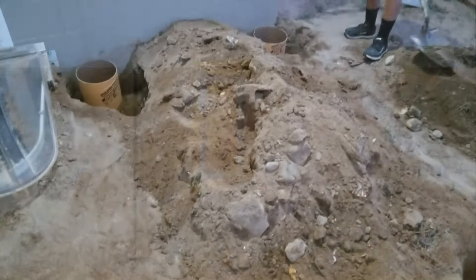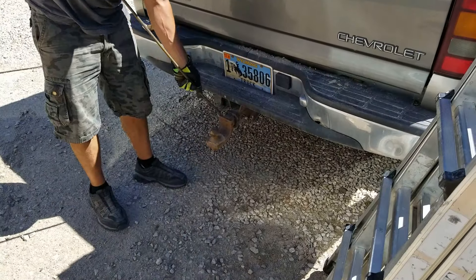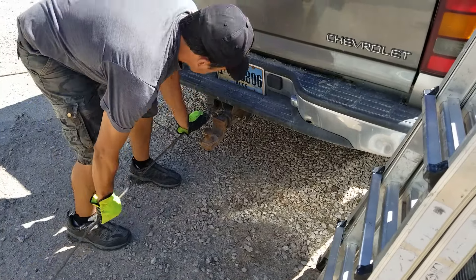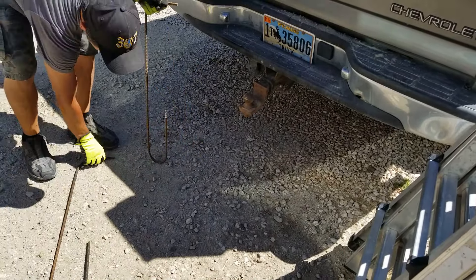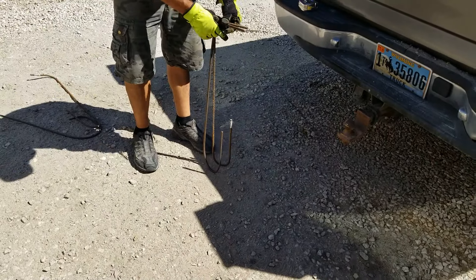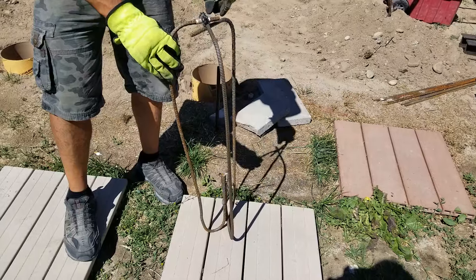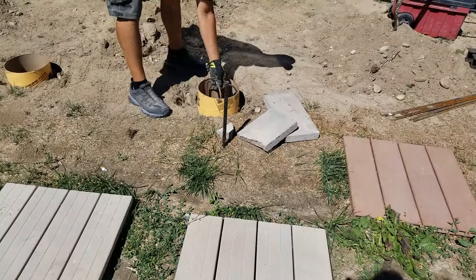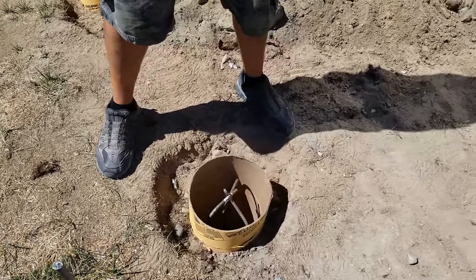Right here we are backfilling the building form tubes, and the top of these tubes are just going to be slightly above ground level. Now it's time to make some half-inch rebar cages to go inside these tubes. They do make rebar benders, but if you don't want to buy one you can get creative and use a bench vise or even a truck hitch as I'm using right here to bend the rebar. I bent three pieces of rebar into the same shape, then tied them together in a triangular pattern to make a cage. Keep in mind the cage should be at least one and a half inches from all outside edges of the concrete.